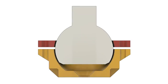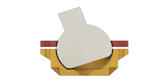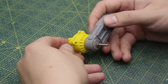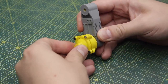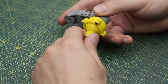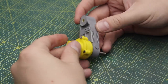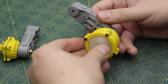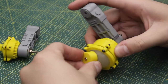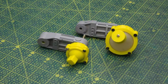When you cut the bottom third of the ball, you kinda limit the range of movement, but at the end of the day it has about 40 degrees of freedom, and that's more than enough for the robot. So here's the new assembly — the smaller intermediate leg piece with the third version of the ball joint. This newer version has enough freedom of movement for the robot, it looks super interesting, and compared to the big bulky second version it is much smaller and looks better against the robot. If you're interested in printing those ball joints, I have the files available for my patrons on the combat robot tier.